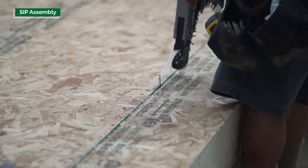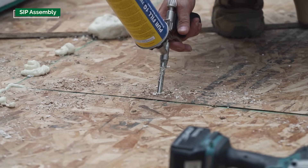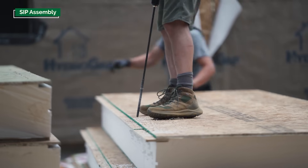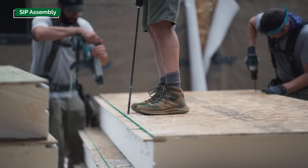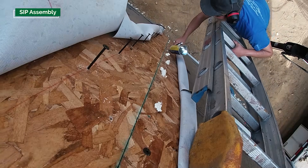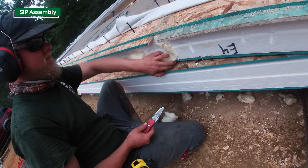One of the most critical parts of a successful panel installation is filling all voids between panels with foam. We don't want warm moist air from inside the building leaking into the panel assembly where it can reach the dew point and go from vapor to liquid. We avoid that by making sure the panels are completely air-sealed with expanding foam. While the panels are on the ground, we drill holes through the exterior OSB so that once the panel is up in place it's very clear where the expanding foam goes. We go into much more detail about SIP panels and installation in our Building with SIPs online course — check it out at the link below.